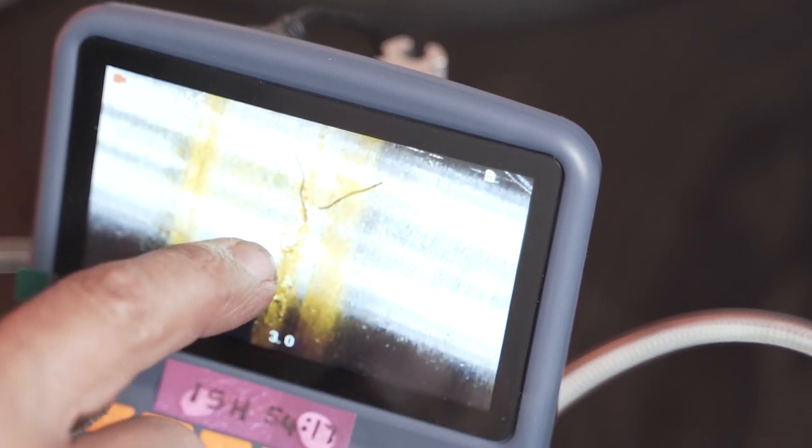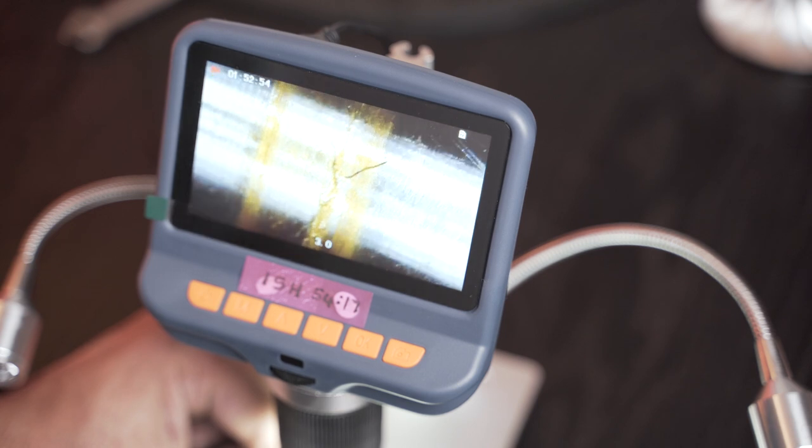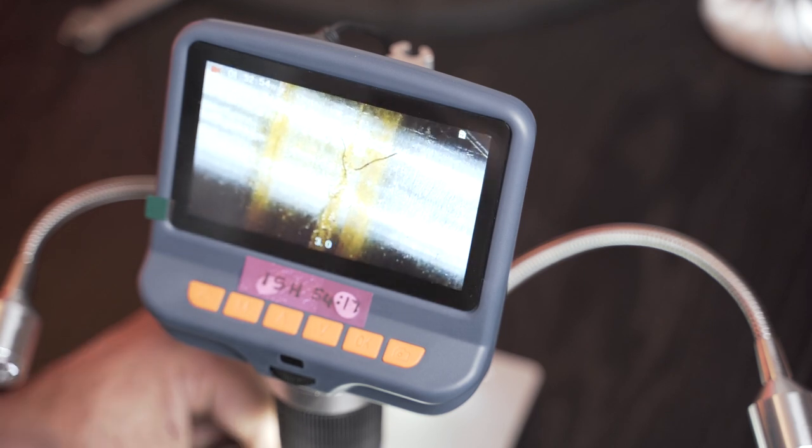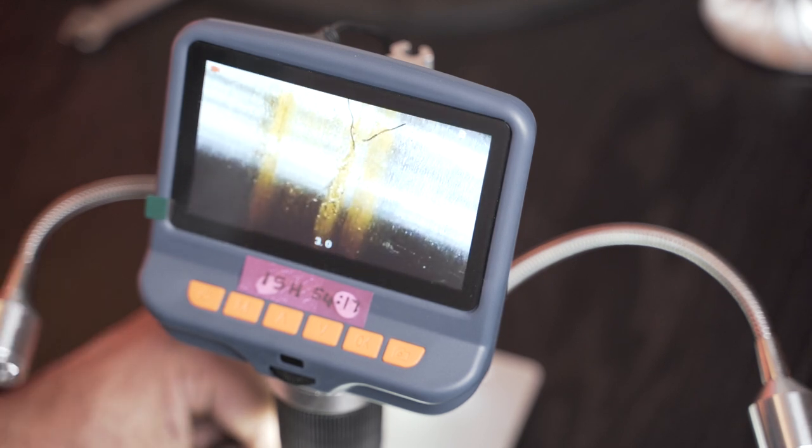And you'll see that section over there looks like two pieces of hair or whatever it is, but that little globule there. So what actually happens is the bearing surface will reach its thermal ceiling, it'll become molten, it swipes or welds itself onto the shaft, and it builds up in the direction of rotation. And as it builds up, it wears away the inside of the bearing, it continues to rotate, wears, builds up, wears. Eventually there's sufficient clearance axially and radially for the blades on either side to touch the end housings.